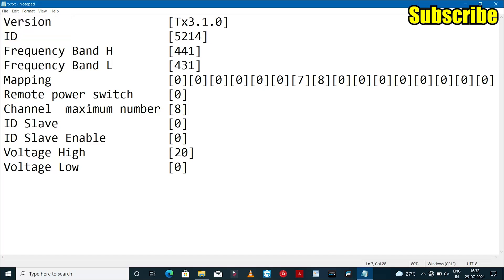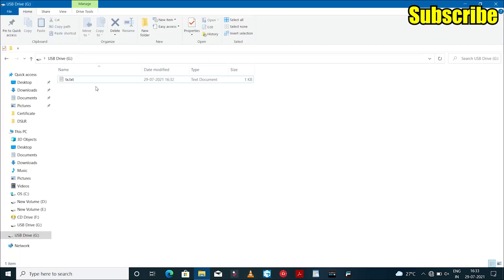If you want to use channels 5 and 6, or 5 and 7, or 6 and 8, just edit the numbers to the appropriate channels. At least with the MFT-Link UHF system, this is how you edit the files. If you're using Dragon Link or any other UHF system it will have its own software and you'll make changes there. Also note this setting only applies to the UHF transmitter — no changes are needed on the UHF receiver.